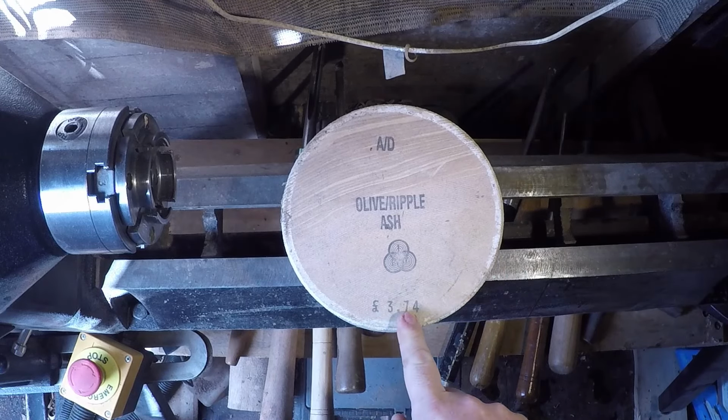Well, that previous episode resulted in misery in the man cave. A small catch unexplainably released the chuck from the thread in reverse, even though the grub screw was tightened in. Of course, the result was that the grub screw tore out part of the thread, so I've now had to perform thread surgery on the lathe head.